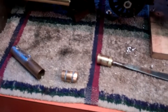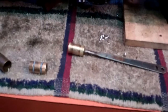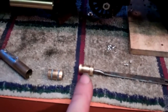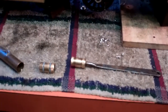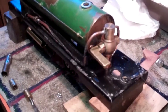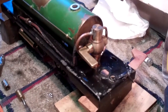Upon further research I found out that the little rings in the pistons are to hold oil when you run this. So I went back to the lathe and machined new pistons very carefully — sized them to about half a thousandth undersized — and I put two little ring grooves in there to hold oil. I found out you want to use a fairly heavy weight oil in the pistons. These engines are known to run really fast, so I made this valve here to control the steam output to the cylinders to act as a throttle control.